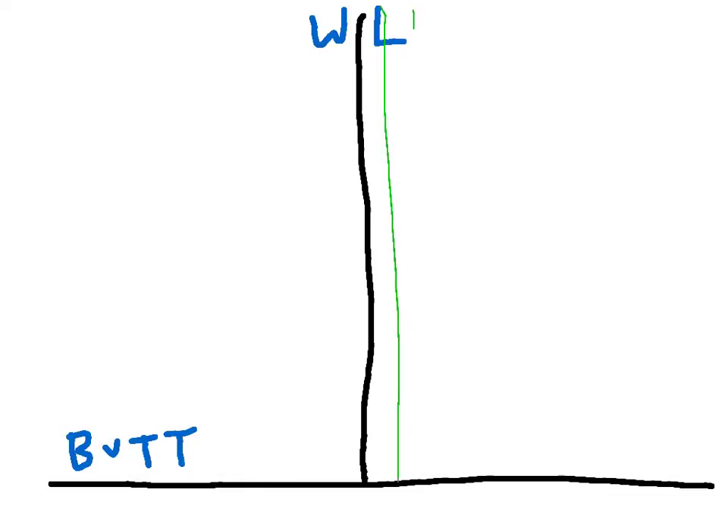In this video I'm going to quickly show you how to do a table of offsets, and we're going to start with doing a Cartesian plane. The Cartesian plane when you're doing tables of offsets: the x-axis we refer to as the butt line, and the vertical line or the y-axis is the water lines. It's also often times very helpful if, as you're drawing up your plans, you actually draw yourself a little Cartesian grid.